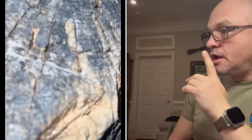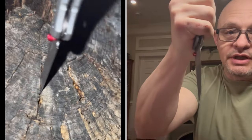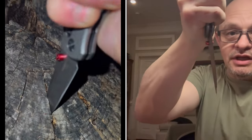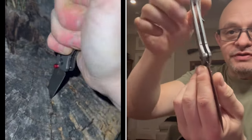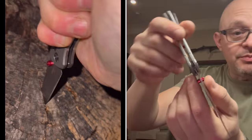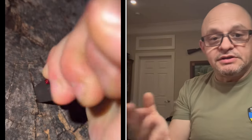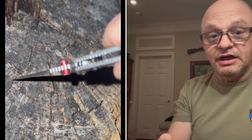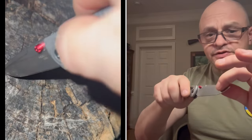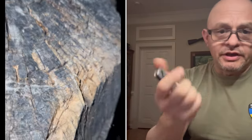I'll do a separate video with a disassembly — we need to know what's inside this knife. In the meantime, let's go back to the tree of doom. In this test I'm inserting the blade into the crack on the stump, the blade is arrested, and then I apply torque — a twisting moment — to see if I can damage the frame, loosen it up, or impact the pivot. To me it's a toughness-of-the-entire-assembly test, and in the end I check for play and then look at blade centering and closing.